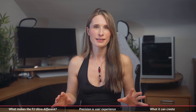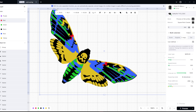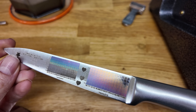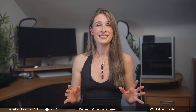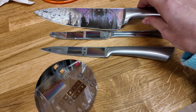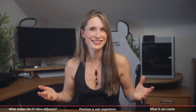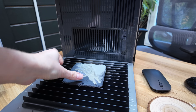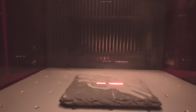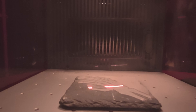The MOPA laser carves through metal with ease, not just allowing etching but also cutting out intricate shapes. The MOPA's control of pulse width allows for some showcase features — it offers so much precision you can control the colour of the end result in metals, giving up to a hundred different colours. This is exactly where flagship features come into their own. You'll know how much more value you can add if your business is turning plain metal items into engraved bespoke designs — but if you can extend to multicoloured, well, that's just another level. This was easily produced in less than half the time, so if you want to batch produce items like this, the triple power and faster speed becomes cost effective quite quickly.